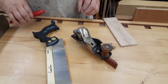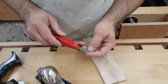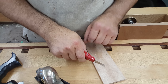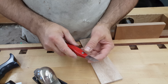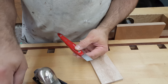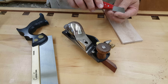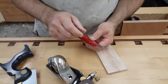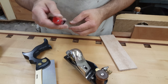The dovetail marking knife. My new method of cutting dovetails uses the kerf in the tail board to actually mark the kerf into the pin boards. This blade has the exact same thickness of steel and set on the teeth as my dovetail saw. So if you are anywhere around 24 to 26 thousandths saw kerf, this will work — in other words, you can actually use the saw to do the same job.